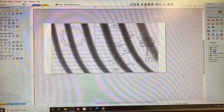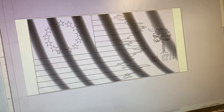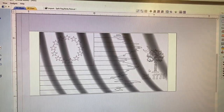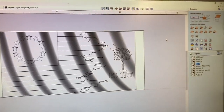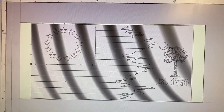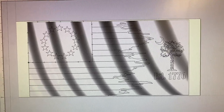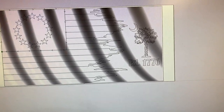I just realized I didn't go over the V-Carve part of it, so I'm going to go over that real quick. The first thing you'll see is the vector file sitting on top of an STL model — that's my model number four. This is an SVG file that I created. When I'm doing my flags, as I talked about with the union, I will cut first after I've done the wavy pattern. You can see the arrows — I will cut that at about 0.06 inches deep, which cuts a shallow little groove on the wavy pattern. Then after it's cut I'll go in and paint it blue. In this case I did a profile cut.